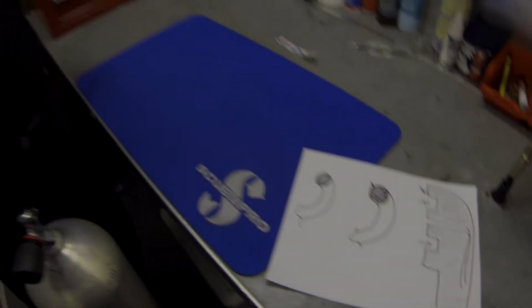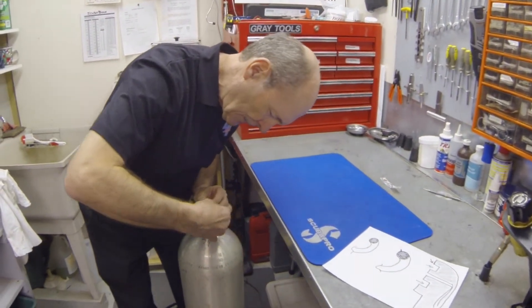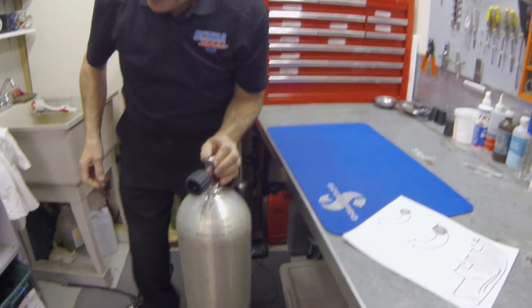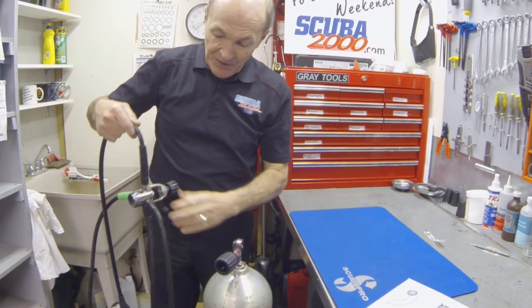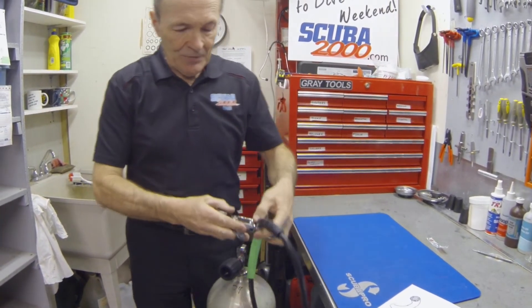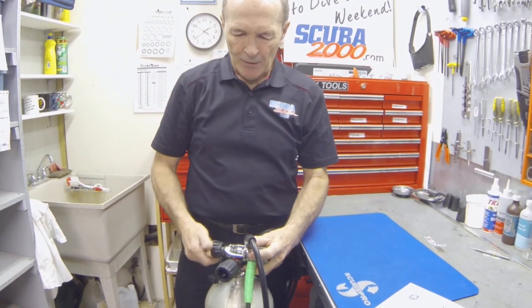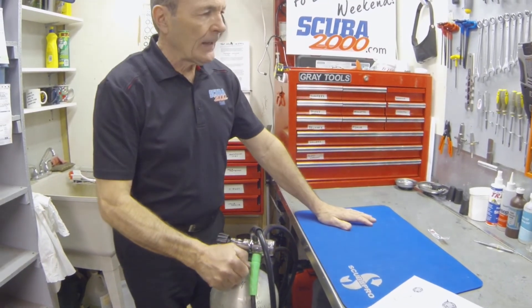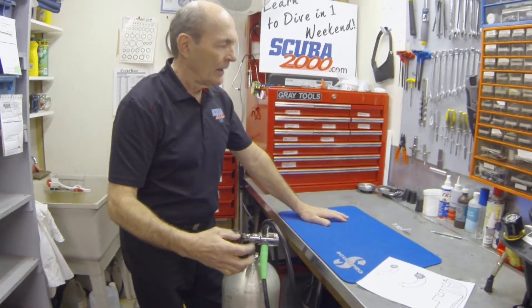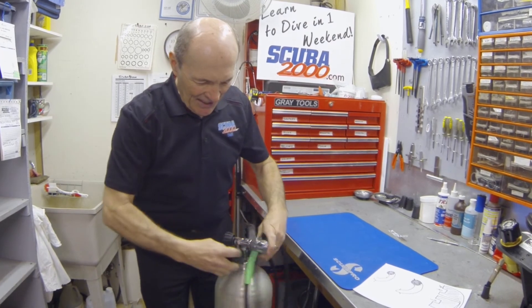Let's give it a try. That's the worn side — we'll take it out, flip it over, put it back in. If it's really dry and you happen to have some silicone grease, it's not a bad idea — a tiny bit of grease. Vaseline works too, and sometimes I've even used ordinary water, a little bit of water around the O-ring. So I flip the O-ring over, put the regulator back on, turn the tank on. Let's go diving — turn the air all the way on. The indicator shows the air is all the way on. We just saved the dive!